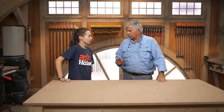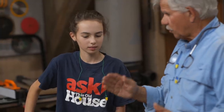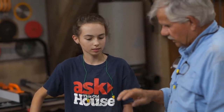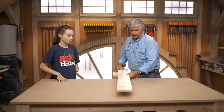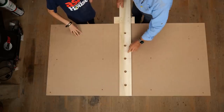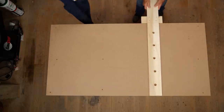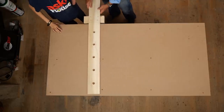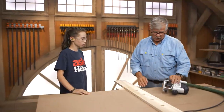I think it's a nice height. Now there are a couple of little things we want to do. First, we want to sand off these edges because they're a little bit rough. I also want to drill some holes in the bench — we can clamp to those holes, and they have these pieces of metal that'll stick up or you can push them down, called dogs. So I made a jig. This jig is where we will position the holes — equally across here, a row here, another row here, and a few more, which gives you plenty of locations to put clamps.